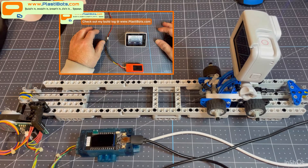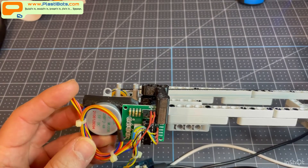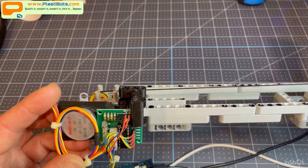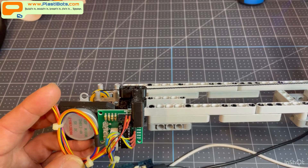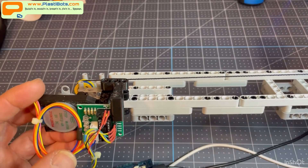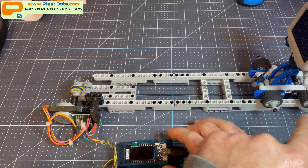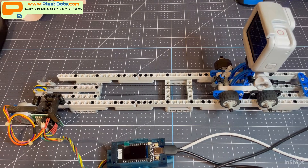This is the next phase with a few changes. I changed over to a stepper motor - my previous motor wasn't a stepper at all, I was just guessing based on timing. I needed accuracy where I could use a total number of steps and do math to determine how far the slider goes over time. This is a 28BYJ-48 5V DC stepper motor with a ULN2003 driver board hooked up to the TTGO with four wires plus 5V power and ground. That controls the steps.